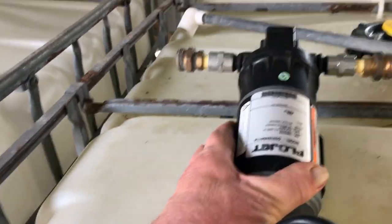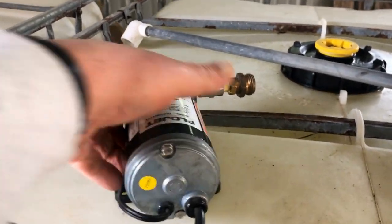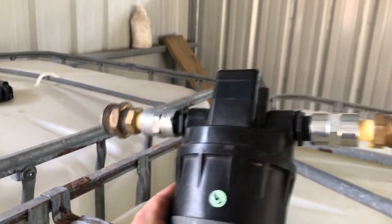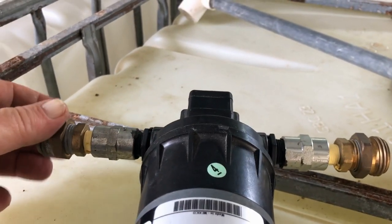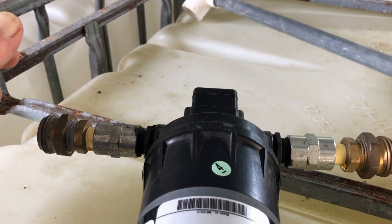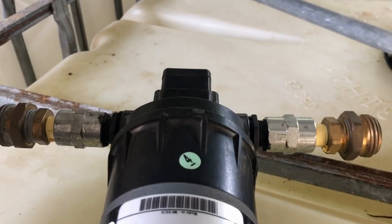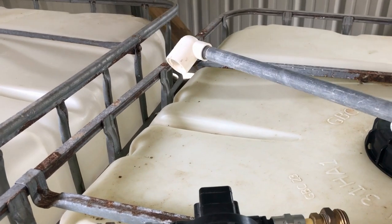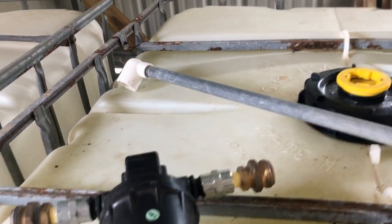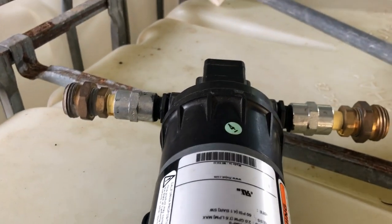Another easy way to do it is to buy a separate auxiliary 12-volt pump — or like this one, actually a 110 that just plugs into an outlet. This one doesn't have a switch on it, so as soon as you plug it in it starts pumping. I use this for pumping out of barrels or various things with water hoses. But you could get the poly fittings that would fit your half-inch hose, put your inlet drop stick into the tank, and then hook the outlet up to your bleach tank on your truck or trailer. Plug this in and it would start pumping.